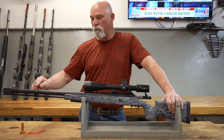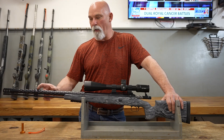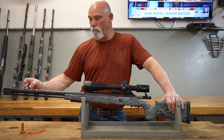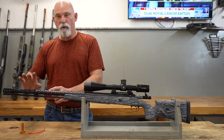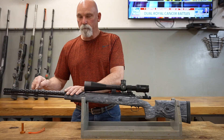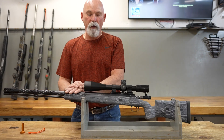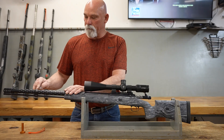We've got one of my barrel bands — Hank's Precision Gun Parts — we make those here in the shop. That barrel band is made to fit this barrel at this location, and I offer them in three different sizes depending on where you cut your barrel off. If it had been a 28-inch barrel, I would have used the next size; if it was a 24-inch barrel, I'd have used the next size bigger. Any of you guys that are gun builders and want to add a ramrod to your gun, check out these barrel bands. They work really nice — they've got a hidden set screw that you can't see. They're not like the split clamp style.